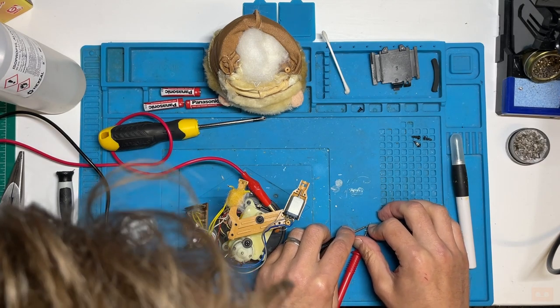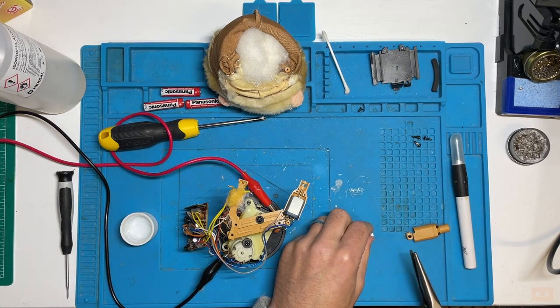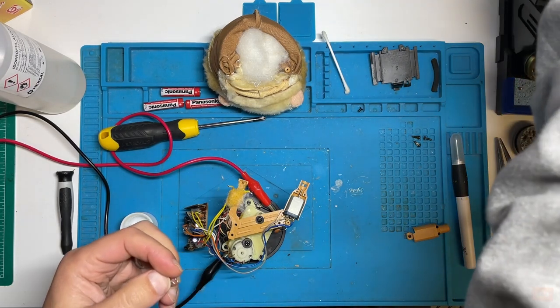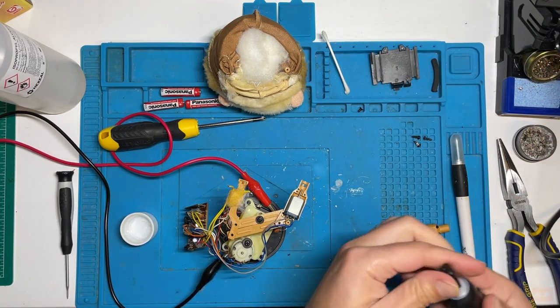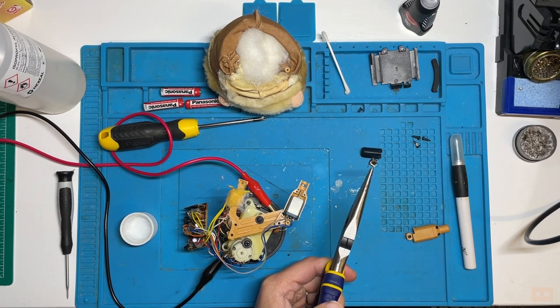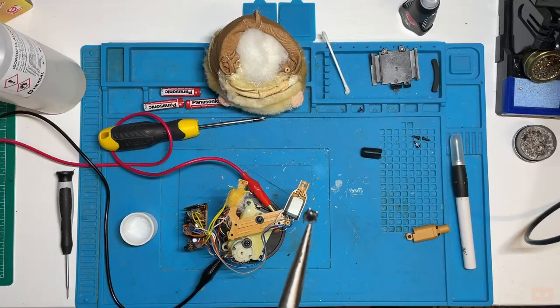We have continuity — so that's a switch fix. I'm going to gently press it in place and then pop some glue. I'll use the super glue precision power gel with the precision nozzle. Then re-solder it in. Hopefully when we push the button it will come to life and we can start moving on to having a look at the cogs inside the motor.